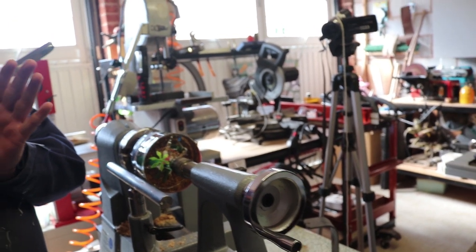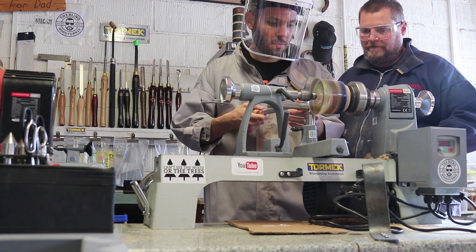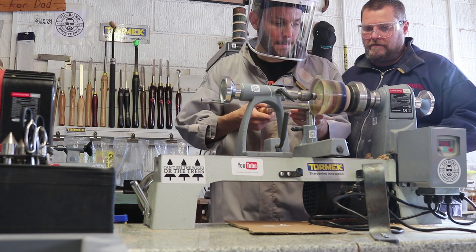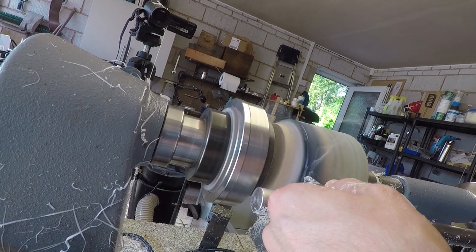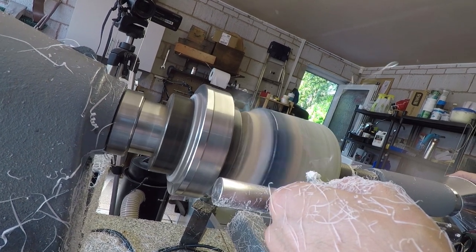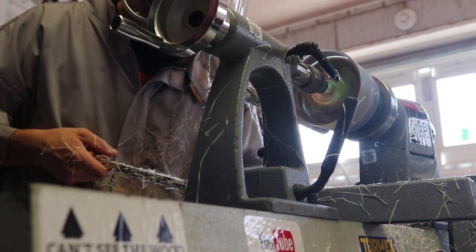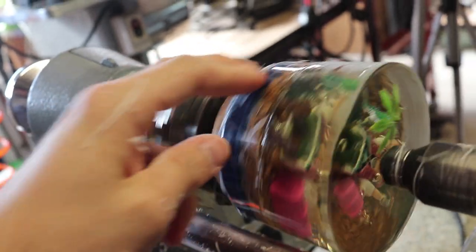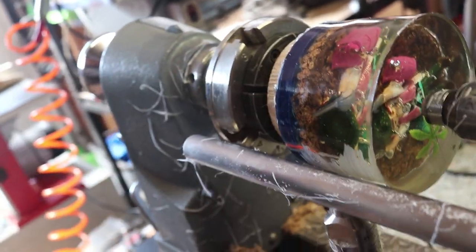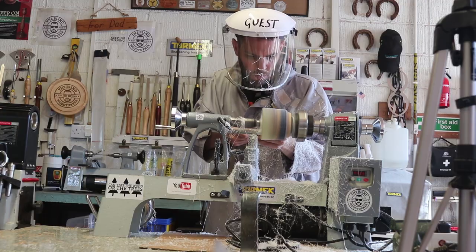It's eccentric at the minute, not concentric, so you're going to get this into true — it's going to be more of a cylinder. So nice and gentle. This is taking off just a little bit of the shavings, even though I thought I'd taken off a lot. I would then repeat this process of taking off small sections of resin. With epoxy, you have to go a little bit slower than with wood because it's not as forgiving and it may chip. It's really relaxing when you get into a cool rhythm.